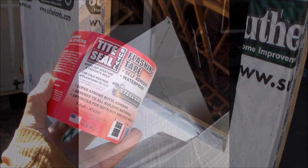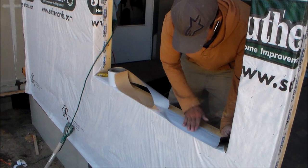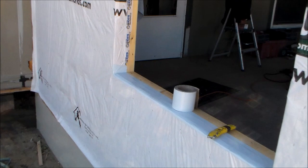To prepare for these windows, it was fairly easy. I started by applying house wrap to the sheeting on my house and covered approximately half of the frame window opening with the house wrap as well. Then I used some window flashing tape to completely waterproof the framed window opening. It is self-adhesive, and I applied it to the frame opening overlapping the house wrap.